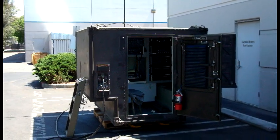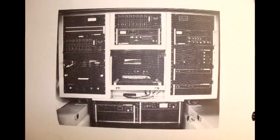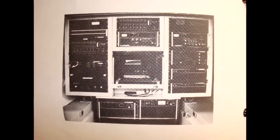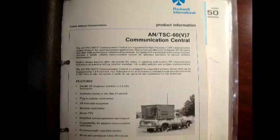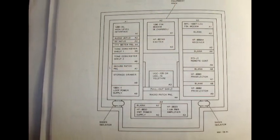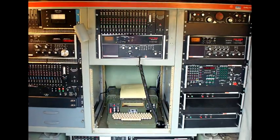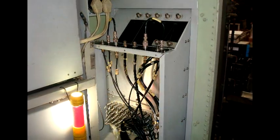You could put a 10-kilowatt on this through the patch bay — like the one you have in your warehouse to a dummy load. What got you started on this HF80 thing? Well, I collected S-line equipment, and then started collecting the literature of Rockwell Collins. I found a brochure for HF80 and said, 'What's that?' I started looking around and finally found an A51S unit, then found out there was a whole lot more. So I started getting a receiver, an exciter, an amplifier, took a lot of shelters apart, built my station up with this stuff, and then went back and put them together.